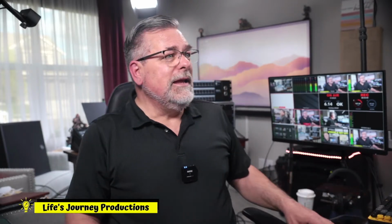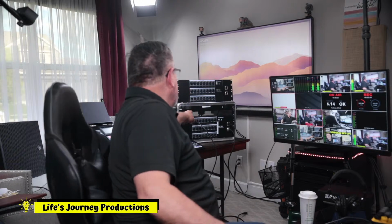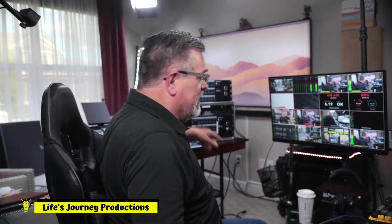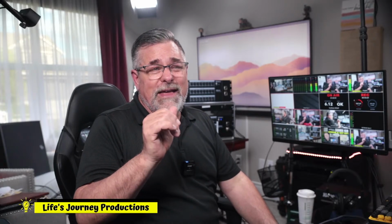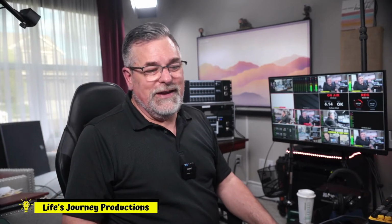So basically, what does that mean? That means I can assign channel 16 right here. Channel 16 could be assigned to my digital patch snakes. We're not going to cover that tonight, but I now have the ability to send all of the signals from inside my StudioLive 32 console to those stage boxes, and they can be daisy chained on the stage, but I'm actually going to get a device that can network them. So I can send one cable to the platform and then network them. So if one device fails or powers down, it won't unpower all the other signals going down the chain. So I will literally be using a 5-channel power over Ethernet. Now, it won't power these stage boxes, so they will be independent, but the in-ears will be powered over Ethernet when I get all of this set up.